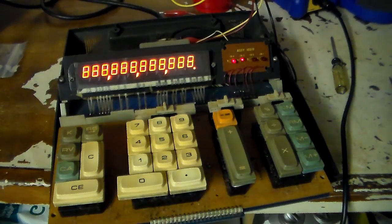It's been about 20 minutes. I put all eights on the display just to make sure everything is working fine — it didn't cut off once in 20 minutes, whereas before I recapped it, it was cutting off. So I'm going to go ahead and call this fixed. There's a slim chance it might stop working, but I'm going to go ahead and call it.